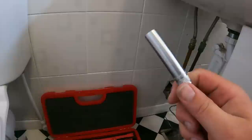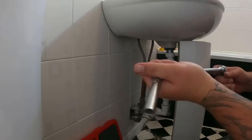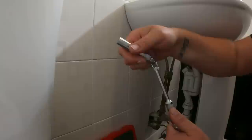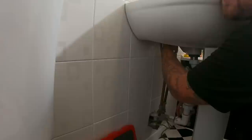With the waste in now we can get the tap out. It's an 11mm socket. I've just tested it up there to see if it works and now I'll connect it onto the Nurad TapX kit. If you haven't seen these before, they are an absolute godsend with anything to do with taps - bath taps, basin taps, kitchen taps. You've got a ratchet on the bottom, an extendable bar, extension bar, and then the top bit is on a complete knuckle so it doesn't matter where the fitting or bolt is, you're going to be able to get to it. It just makes life so much easier. They are expensive - I think about £130 - but once you've used them once you completely understand why people rave on about them. It's probably one of the best bits of kit I've bought. So we'll get that out, get it disconnected off these flexes and put the new tap in.